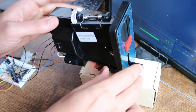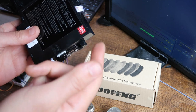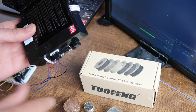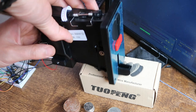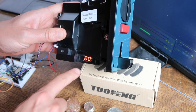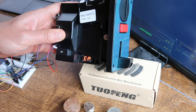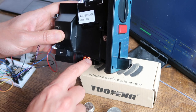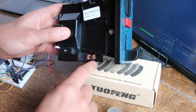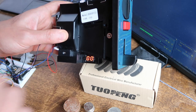Now it comes time to program our coin mech, the DG600F. There are three little buttons on the back. Make sure switch 3 is pushed to the on position — that means instead of sending pulses to the ESP32, it's going to send a character array of the number we set. There's also an A button and a B button. If I hold down A it makes a clicking noise and we get CP — coin program. I'm going to select coin one, which is our first coin to program. I'll press B once, because I only want the number one to be sent down the signal pin when that coin is put in.